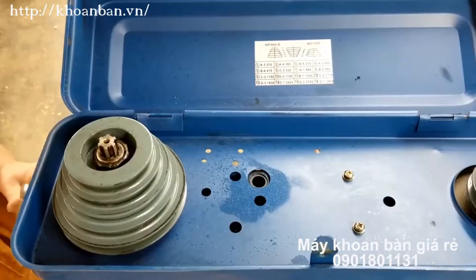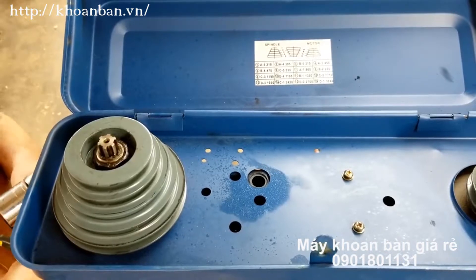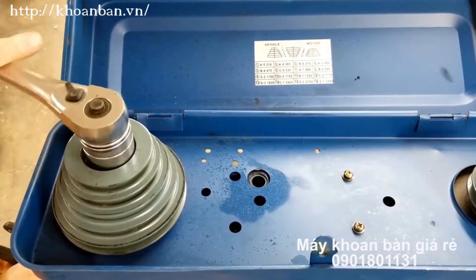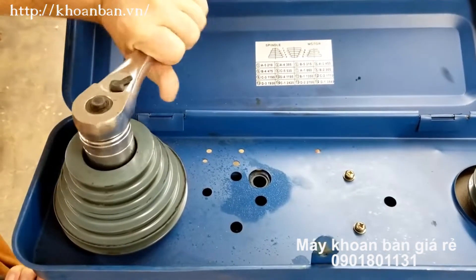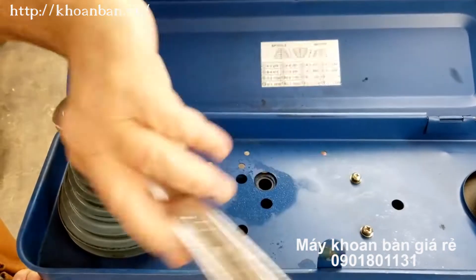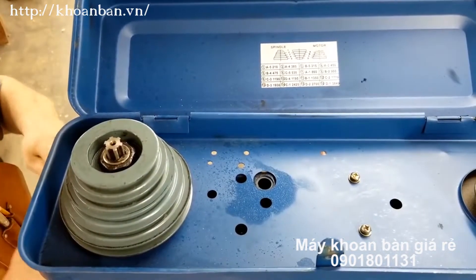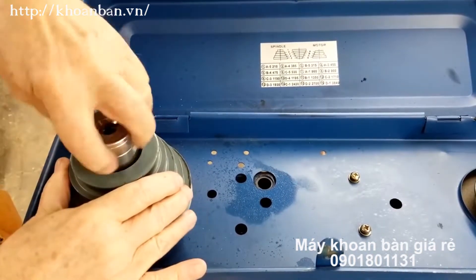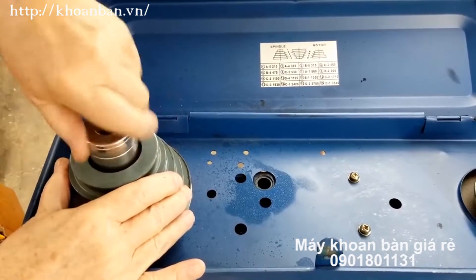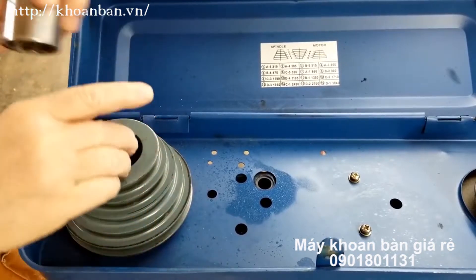We don't have to take off the pulley on the motor because the hole in the pan is big enough for it to slip through. But the one in front is attached to the spindle, and it proved to be tricky. To begin with, it's held in place by a nut of unknown size. I could not find out the size of that nut by looking in the manual, looking at the diagram, looking up the part online, or doing a general search. Finally, it just came down to try until you get it. I don't have a socket set that big, so I was going to the pawn shop and buying individual sockets trying to match it by guessing. It took three tries to get it right.